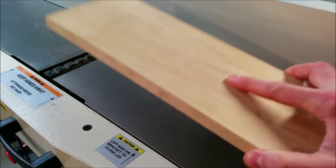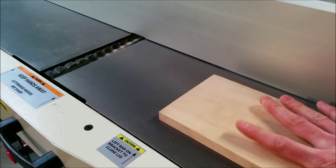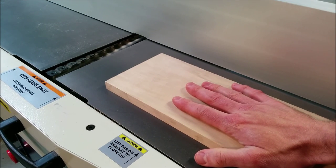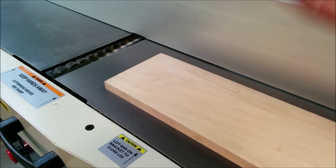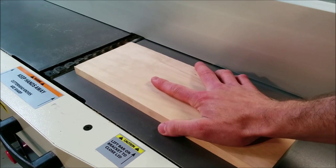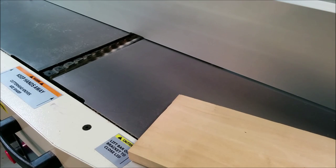as good. I took this same piece of wood and I ran it across this surface as well as my polished bandsaw table, and it was easier to move the wood on the polished surface. So I give Rikon a C for this table surface. I would like to see it be polished. Next, we can talk about the cutter head.